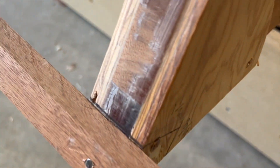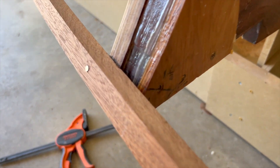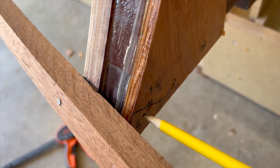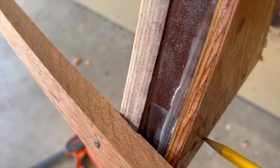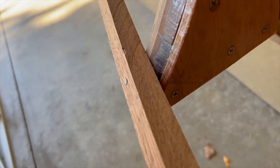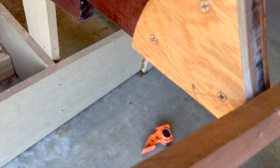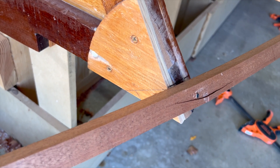When you start getting up to frame 8 there's a little bit of a gap but it's pretty darn close. Frame 7 I cut pretty much flat, frame 6 pretty flat, frame 5 pretty flat. Then it starts going the other way — on frame 4 the gap is on the back side, meaning the batten wants to start curving inward. So if I cut an inch and a half in here, I've actually got to cut in more on the front side — maybe a quarter inch more. At frame 3 there's about a 3/8 inch gap, so I cut even further into the front.